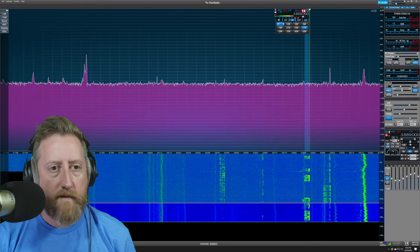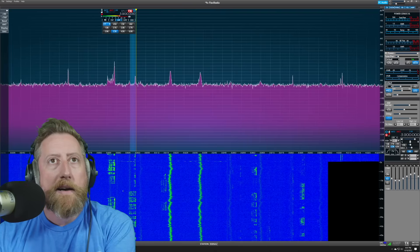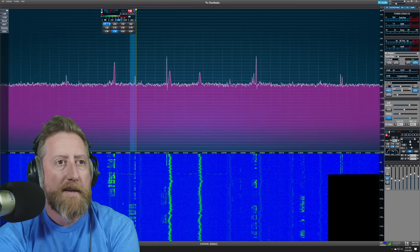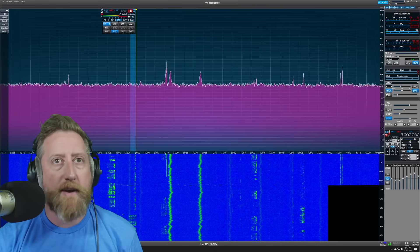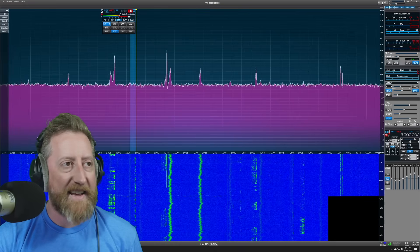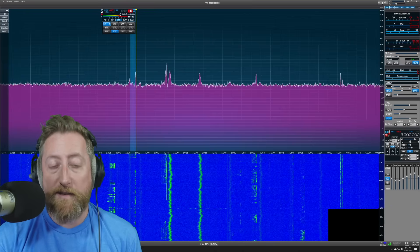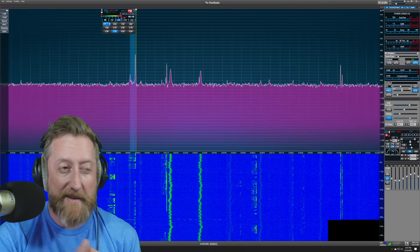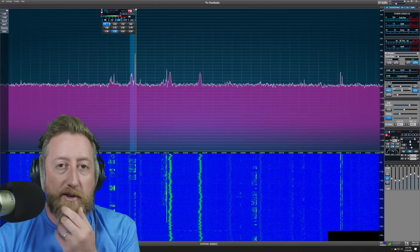It's kind of noisy out here. Let me put on some noise reduction. I'm in the process of making a report, working with the ARRL to track down these new noise sources. It is an appreciable amount of noise. I shut my power off to my home — noise is still there. Powerline came out and did a look-see. They found out that the post office was running a bunch of pulse-width modulation LED lamps, and they are pretty close to my house. I have a feeling that's what the problem is. I'll work with the ARRL and let you know how it goes in a future video.